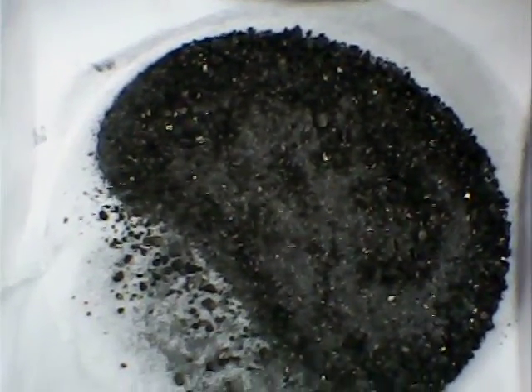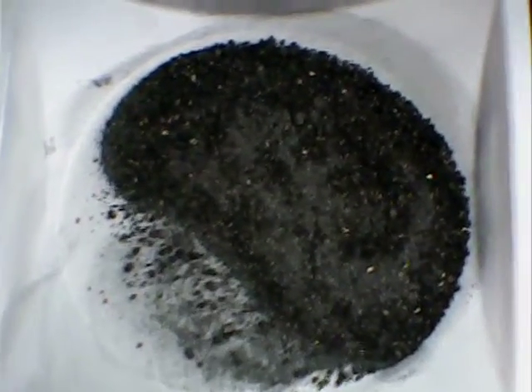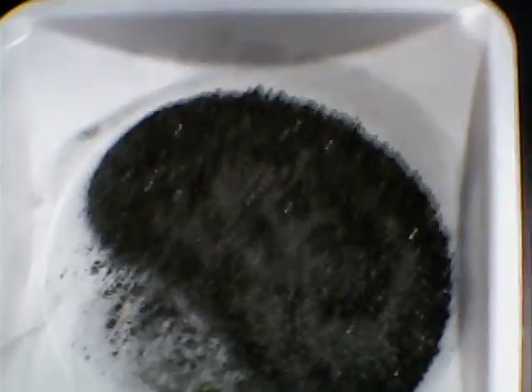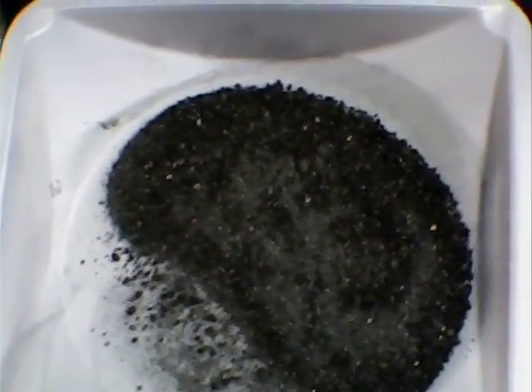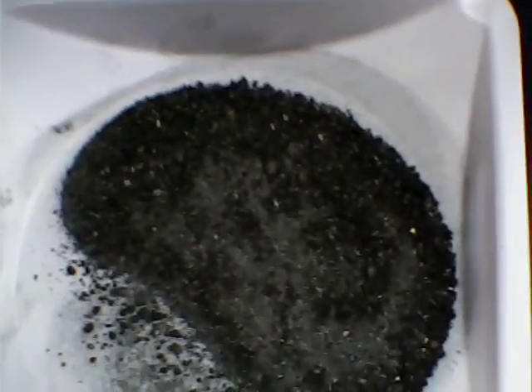I'm also going to make activated manganese dioxide — I haven't done it yet. I grind it up in a coffee grinder. With this prototype, I put in about 95% by mass of this grind and 5% by mass magnesium hydroxide — the milk of magnesia component. The reason I'm doing that is magnesium hydroxide is very sparingly soluble in water; it's a suspension. I'm using aqueous sodium hydroxide as my electrolyte, but I have a hunch the magnesium hydroxide may be a time-release agent for the hydroxide that reacts with the aluminum. I'm hoping to cut down on the 10% sodium hydroxide. We'll see — trial and error. I'll keep you posted.